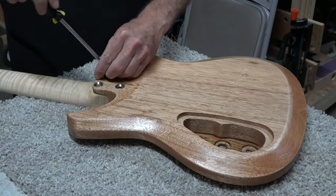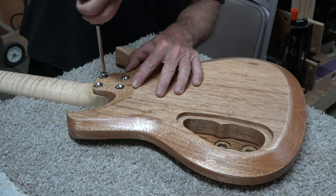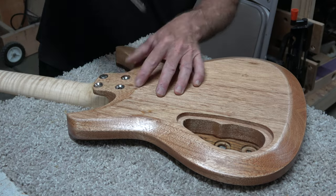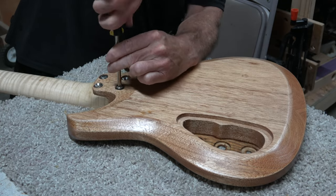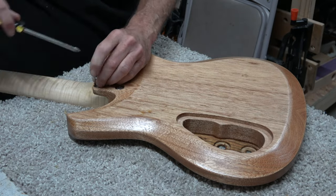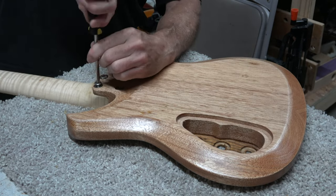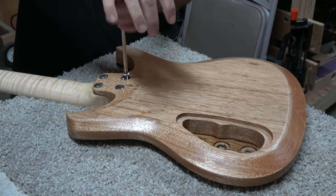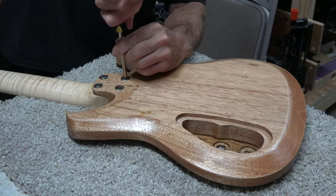Normally when you install a neck into a guitar body with wood screws, you're probably going to use a number 8 screw. However, I prefer to use a much larger, more robust number 14 screw — it just holds the neck in much more securely. I'm not using a neck plate for the screws; instead I'm using screw ferrules. The ferrule I prefer is a billet aluminum countersunk washer. They work really well and are available in a wide variety of shapes, sizes, and anodized colors, so you can find ones that work specifically for what you're trying to achieve.